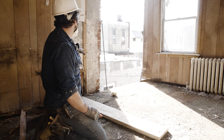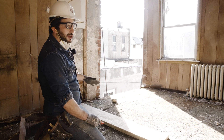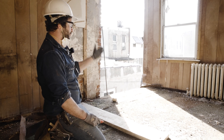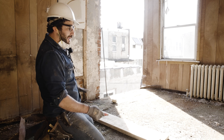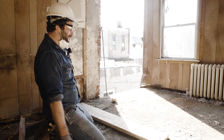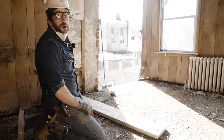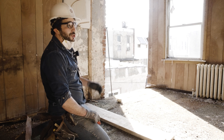I want to get one more star bolt in on this wall. This wall is a little precarious — there's no real good way to fasten it just because the joists are cantilevered out running one direction while the wall runs the other. So I'm going to get a temporary piece of wood screwed onto the floor joist through the subfloor, attach a piece of hardware to mount the star bolt through this brick wall, and just temporarily catch it. It's not permanent, just for when we're doing demolition.